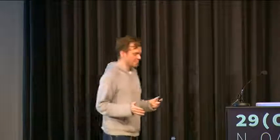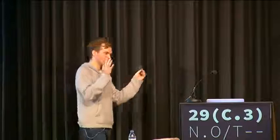Right? There's a couple other ways on other smart cards, especially how to force this, but that's the basic idea. Force the chip to execute meaningless instructions and never jump anywhere. Right? That's the basic idea. It gets a little bit more complicated in cases where memory management is involved, because this, of course, will only ever walk through the memory currently mapped. And if there's other memory segments, this attack may need to be executed several times when the right portions of the memory are mapped in. Right?